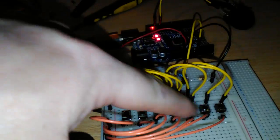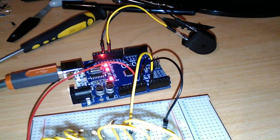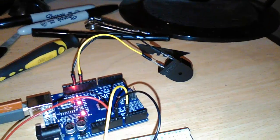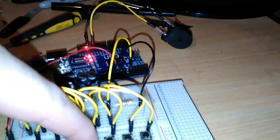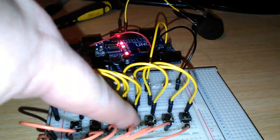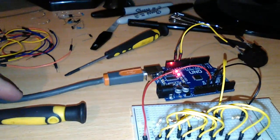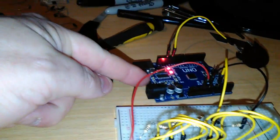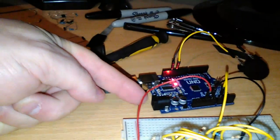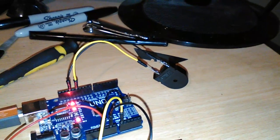When you're actually holding some of these down, you get a sort of warbly effect on the sound. From what I can tell, this has got nothing to do with bounce on any of the buttons, because it does it no matter how hard you hold them down. What I can only assume is that I'm running this board off of the PC's USB port — not only for data but to power the board. If you used a 9V into this bit here, it will then regulate back down to 5V, and it should, in theory, be a lot stabler with none of that sort of pitting on the sound.